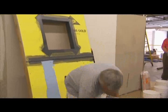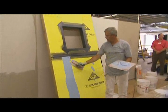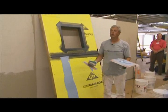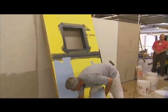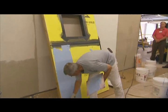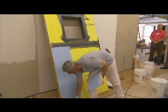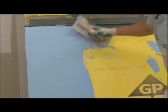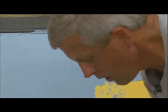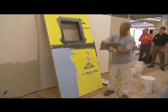If I'm just going to use the texture and trowel it, then all I actually have to do after I treat the joints is wait until you can't disturb it. Just for the sake of demonstration, I'm going to go ahead and coat it now — just imagine we're 30 minutes down the road. All I actually have to do is coat that surface, and even though that tape's not dry yet, I just coat the surface. And it's done.